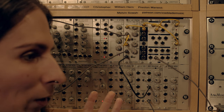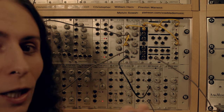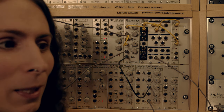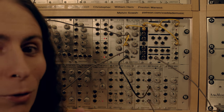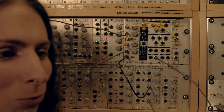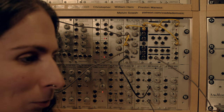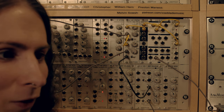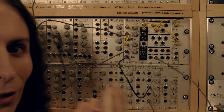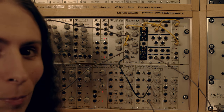And so with a digital sampler, both how often you're sampling the position of the speaker and what number you're assigning as a value to where the speaker is, those are both digital. They're both discrete. There's no kind of smooth curve there. We wait a set amount of time and then we assign it one of a number of positions.